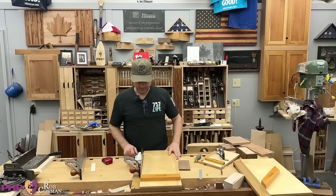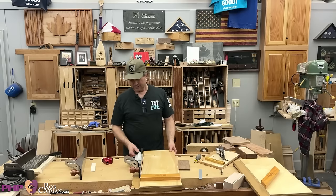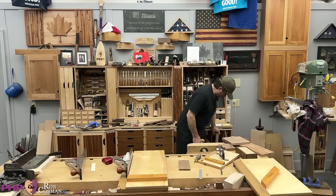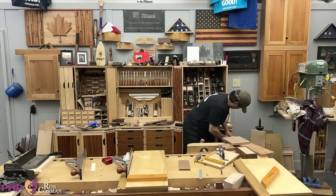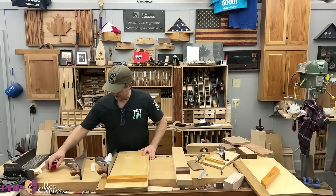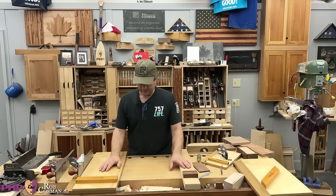Remember, this is something you're going to be lifting up, putting back and forth all the time, so this gets a little tiresome if it weighs 25 pounds. I have a little piece like this. This no longer fits this shooting board. I think this one does. I just made a little device like this. Nope, that's my actual shooting board. Somewhere in here, I'll use this as an example. I just have a second piece like this that I can put. If I'm planing a wide board, I'll put that over there, and that'll support the other end of this so that it's laying flat over here.